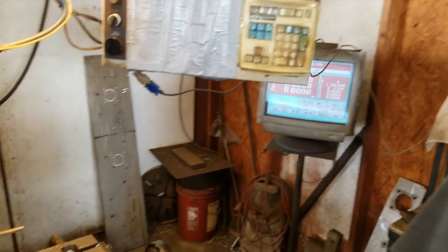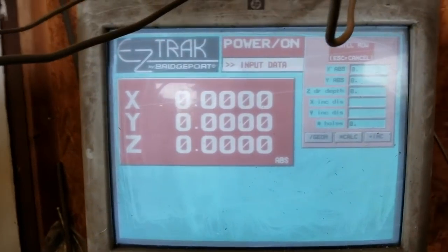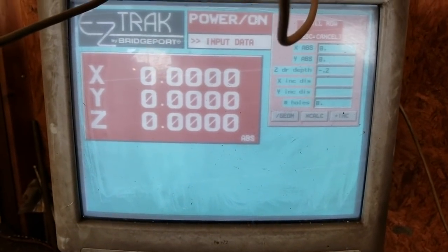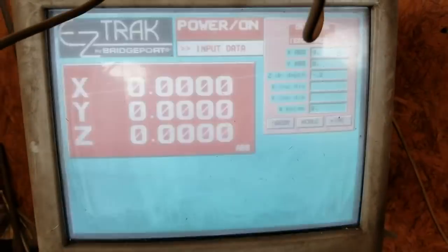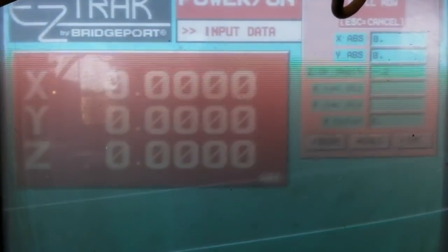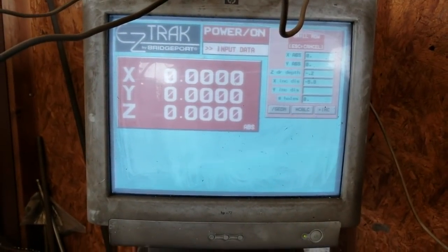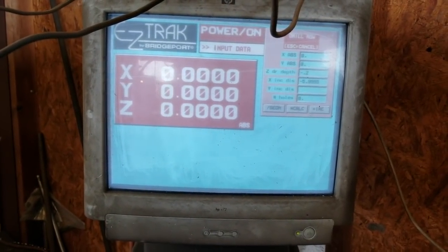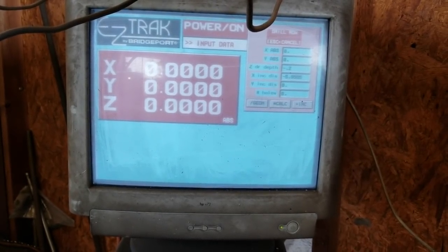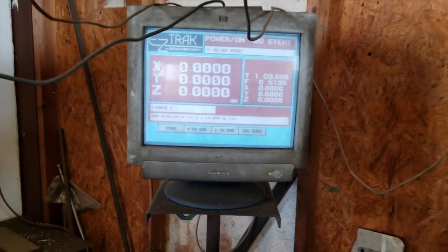All right, we're going to drill a row — seven. Okay, we're starting at zero, zero. The depth is 0.2, close enough. We're going X to a minus 5.995. Y: zero. And we're doing ten holes.